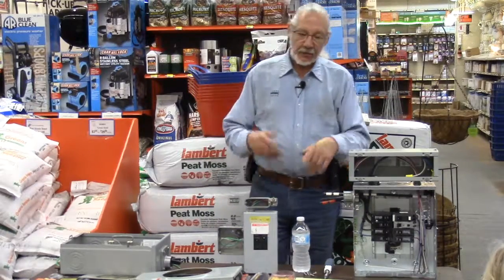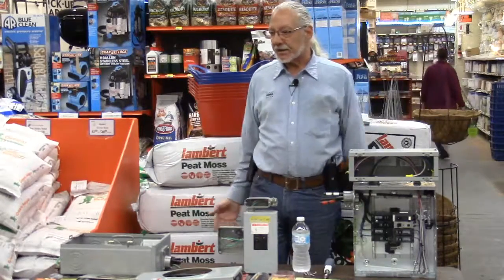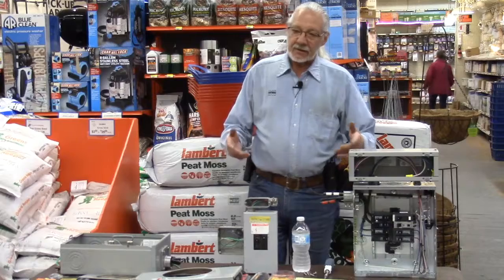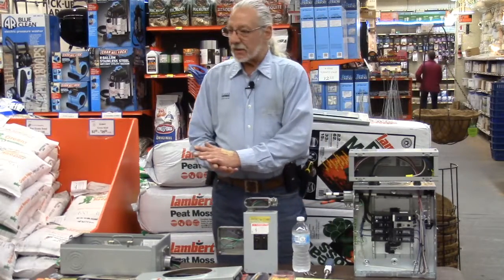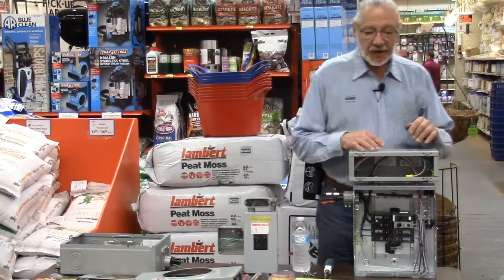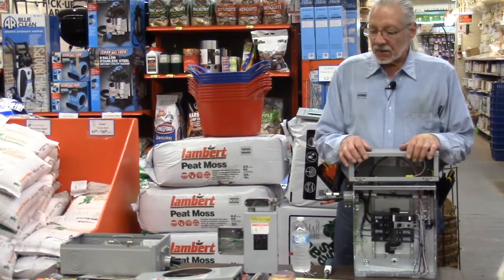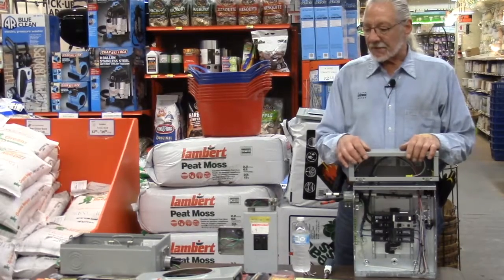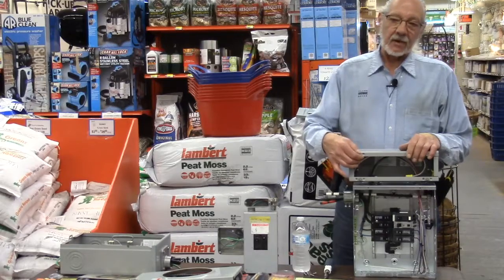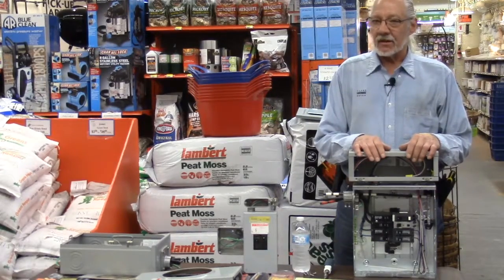Okay, they're arcing within themselves. They're on carpet. When you go to clean and vacuum under the bed, you roll it out. Well, you just rolled over the extension cord again. Now you roll the bed back. The wheel may be on the extension cord. You don't know. So hence the requirement for the arc fault breakers in the bedrooms, which has since been modified, at least by the National Electric Code. They want them everywhere. Well, in a new house, I don't know why they want them everywhere, since there's an outlet every 6 feet.